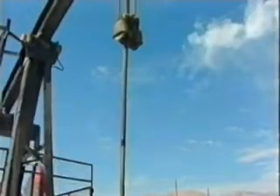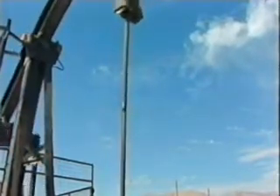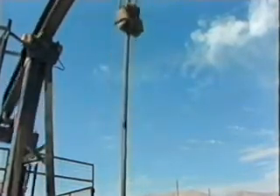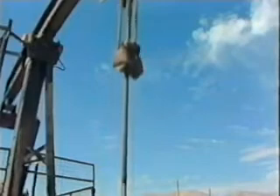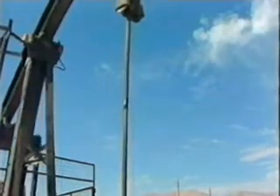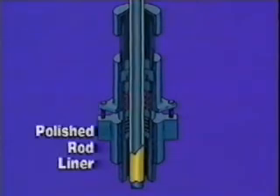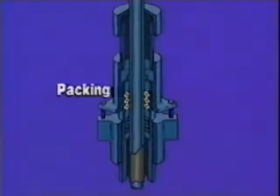Check to make sure that fluids are being brought up to the surface by the rod pump. If the polished rod is hot, the stuffing box may be too tight or a lubricator may be necessary. The polished rod is exposed to atmospheric conditions at the well head — sand particles and general weathering can damage the finish and roughen the surface. Rather than replacing the damaged polished rod with a new rod, the damaged rod can be reversed or inverted and reconnected to the rod string. Another method is to install a polished rod liner, held in place by a clamp; to make room for the liner, new packing with a larger inside diameter is used in the stuffing box.